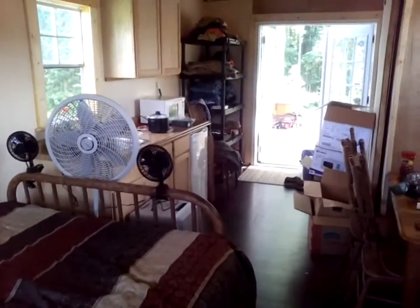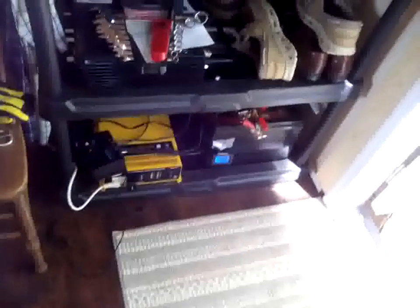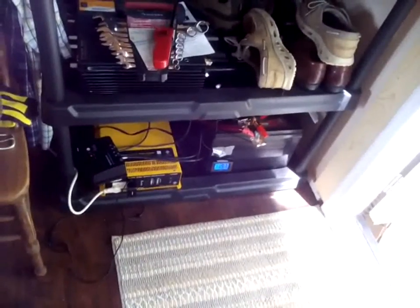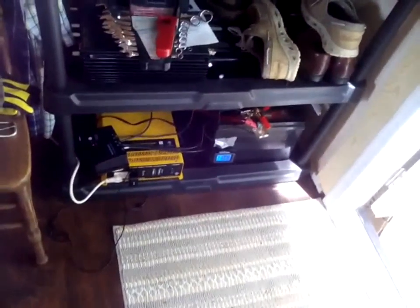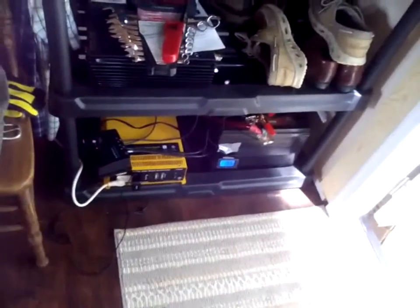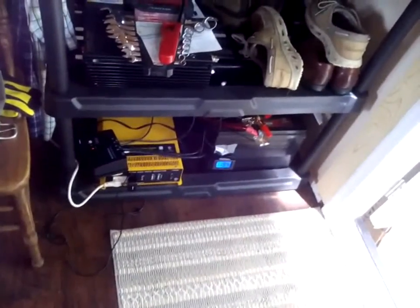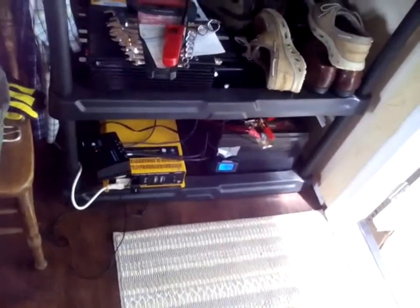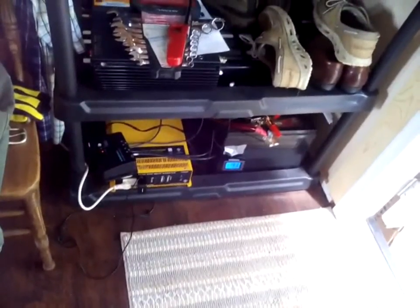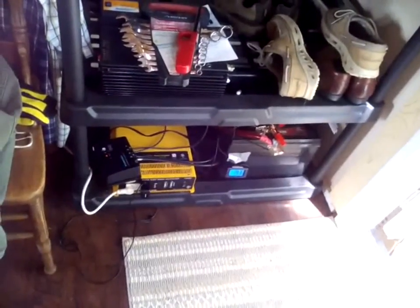The difference between AC alternating current and direct current is important here. I have an inverter as part of my solar panel setup — that's all the inverter equipment down there, and batteries. Those store the excess electricity, but they don't store enough — and they won't even with the new panels — to run everything AC during the night. Just too much current draw. I could get more batteries and have more current; that may be an answer, but I also wanted to explore just using DC equipment.